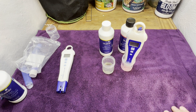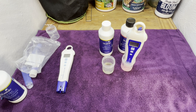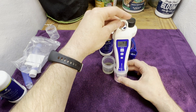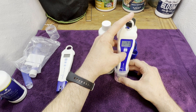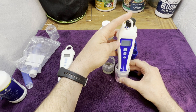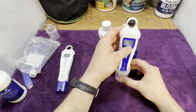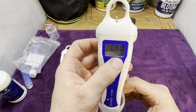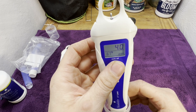Now that it's cleaned off, let's put it in the 4.0 solution. I think I may need to replace that solution — there was a little something in there I didn't expect. It's reading 4.1. Take your calibration button, press and hold — it'll show Cal, flash a couple of lines, and give you four flashing zeros. If it accepts it, it'll put a checkmark right next to pH. And it accepted it — my pH pen now has a checkmark and it's good to go.